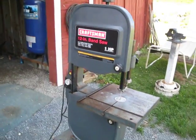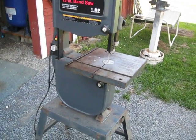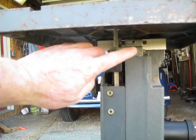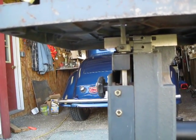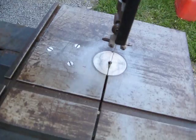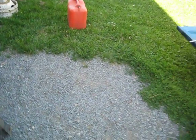Here's what I did with an old Craftsman 12-inch bandsaw. One of my buddies threw it out. It worked, but the tilt portion of it was broke. What I did is I took a piece of aluminum and countersunk it into the frame, then countersunk the top into the table itself. I also had to make the disc that was missing, and I used a motor from a treadmill.